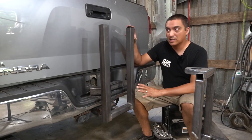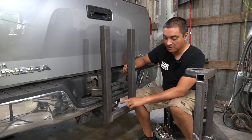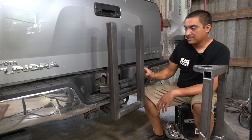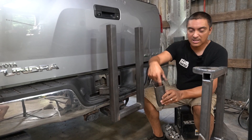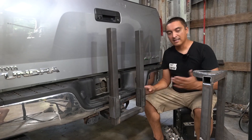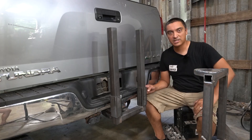This is what I'm calling the frame portion of the motorcycle carrier — the frame looks a lot like some football goalposts. It's made of the two inch quarter wall square tubing with the shim welded on, and these uprights are two inch eighth wall square tubing about 26 inches tall. For the elevator to attach and slide up and down, we're going to use some two and a half inch receiver tubing, which will slide up and down the goal posts and allow the elevator piece to go up and down. Right now I'm going to temporarily clamp the elevator to these, put the jack on, and give it a quick check.